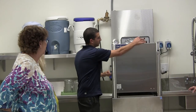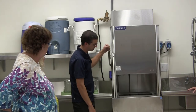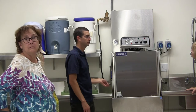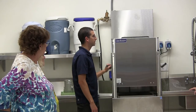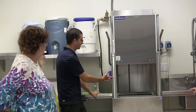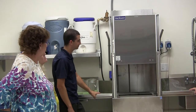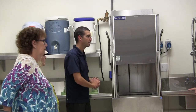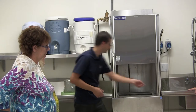So I turned it off right after I drained it, so now you can see it touches all the way to the bottom. It's not doing anything. Okay, and you say to leave it open when it's off. But when we're draining it, it has to be in the on mode with the lid up? I would turn it off. If you have an element there, you don't want the element just sitting there hot. The water does help it a little bit, but you don't want it to get too hot. That's more of a mechanical drain; with electronic, it doesn't have to be on.